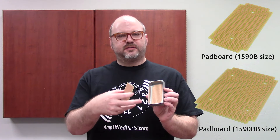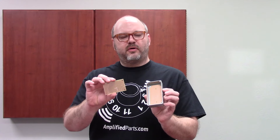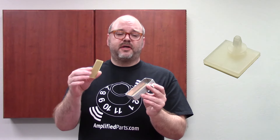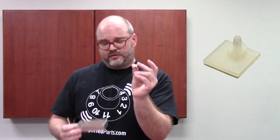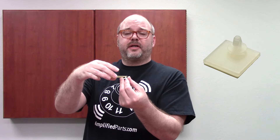The good thing about stripboards and padboards is they are pretty much interchangeable for design — you can use one or the other. You might want to get one of each and see which one you are more comfortable with. We sell the standard padboard that's just a nice square, and we also have one that fits very perfectly inside of an enclosure. This one is a one-hole and this is a two-hole, so depending on how you need to lay your stuff out, one or the other might become more useful for you. We also sell standoffs — if you're using a box, you don't want to set the board directly down on it, as that could cause a short or other issues. These standoffs go right inside and keep your board off of the box to prevent any kind of shorting, grounding issues, or anything like that.